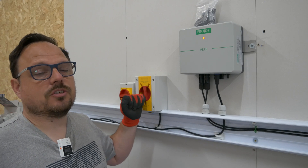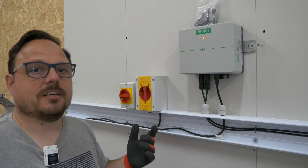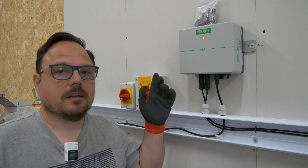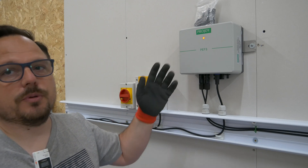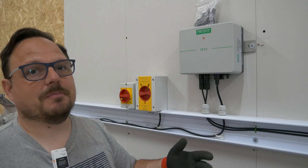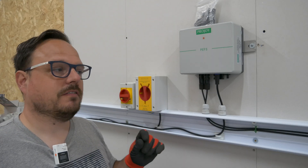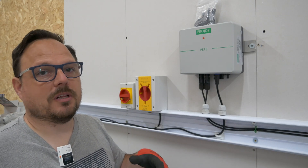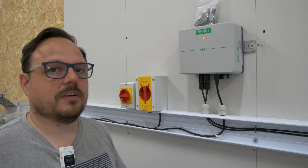You can also install an AC isolating switch which would enable you to activate this at a remote point — typically you'd put it around your PV inverter or at the main intake somewhere where it's obvious to a firefighter wanting to switch off the array on the roof. If we isolate this, you can hear a motor swinging into action inside this device — it's now opening those DC connections from the input to the output. At the minute we've only got the input cables leading into this and we are indoors, but once we've got this up and running with the battery system and inverter we can demonstrate exactly how it works in better detail. When you turn the power back on, the motor swings back in and makes the connection for the DC in and out. When you first power this up there are some capacitors inside that need to charge before they will move that motor, so you have to give it a minute or so on first use to allow the capacitors to charge and then run that motor over and make the DC connection.